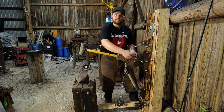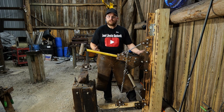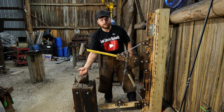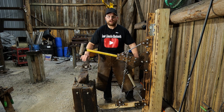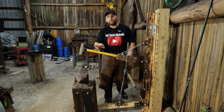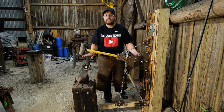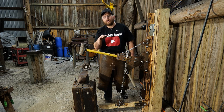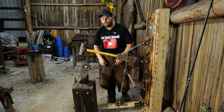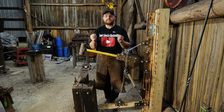Ideally you'll have the hammer in its middle position on this back adjusting plate, and then without anything being drilled or bolted through here just yet, you're going to set the hammer head on your anvil height because that's what will determine your treadle hammer height. You'll set it there to where it is level across, and then you are going to pick up on the back to where the hammer is hitting slightly toe-heavy - as if you were standing on that side of the angle drawing a piece out. That is the correct position for the original setup.